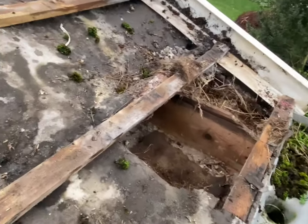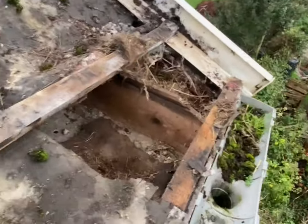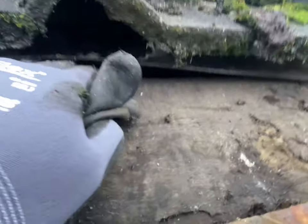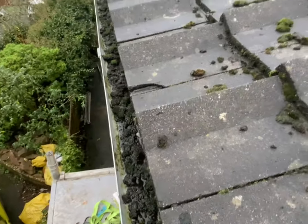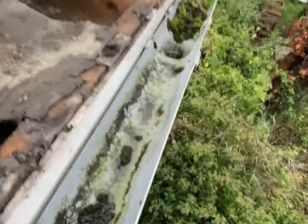So what we're going to do is take these three layers of roof tiles off. We're going to take these battens off, and then we're going to run a new bit of felt tucked in underneath this one here, because we're okay up there. So we're going to leave all that up there, tuck the new one in at least 100mm and then run across. We're actually doing this off a scaffold tower, but ideally you want full scaffolding - but you can do it off a tower.